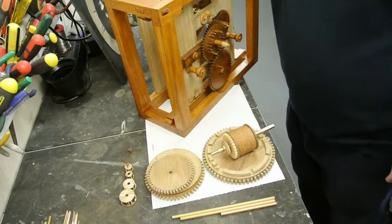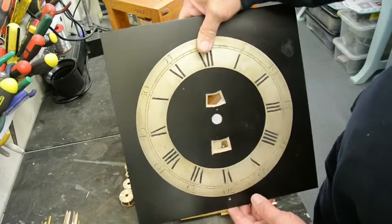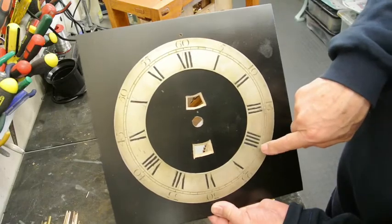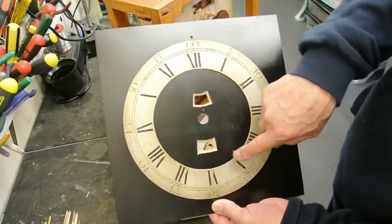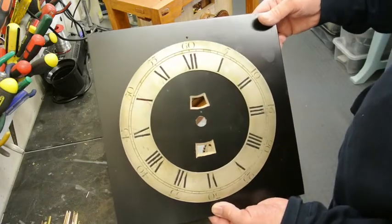And the reason for that is this is the plate at the front, and it will have two holes drilled for the winding squares, and they will look awful if they're not equispaced up and down and side to side from the centre. So